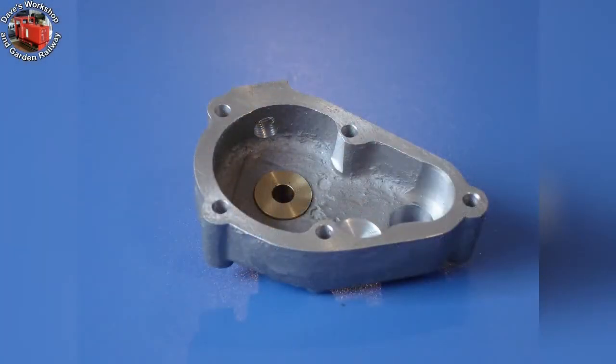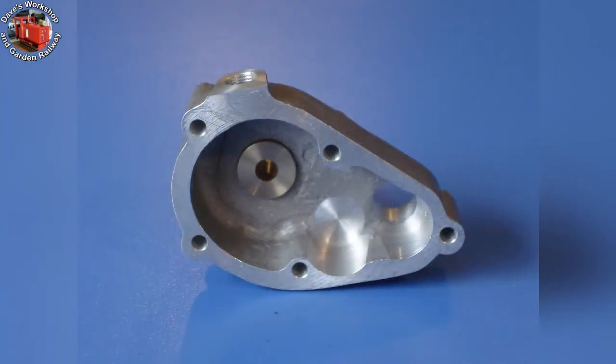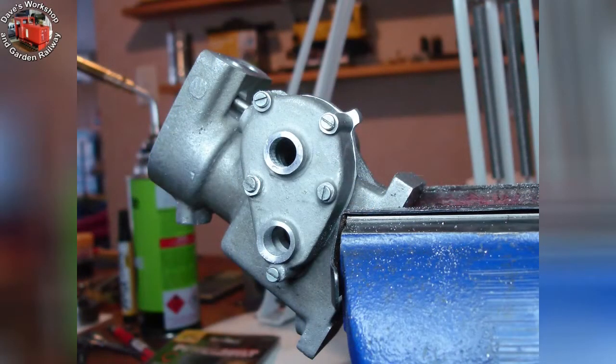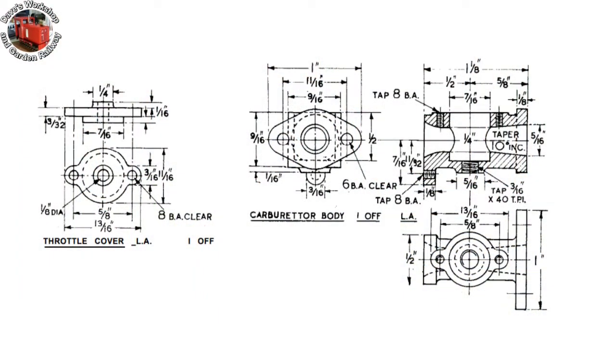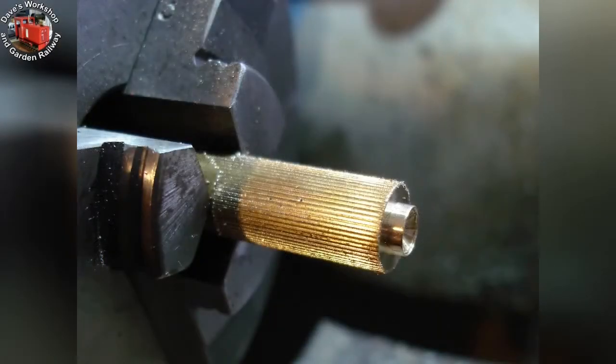Filing down the mismatch between the timing case and the body casting — the body casting required quite a bit of metal removed with a round file. Here is the carburettor drawing; these features were mostly completed 30 years ago. Here is the carburettor parts drawing — only the throttle had been completed, so I made the rest, all from lovely brass. Here is the start of the jet needle — I don't have a knurling tool, so I created a similar effect with a sideways-mounted tool in the lathe.